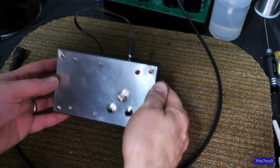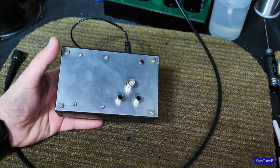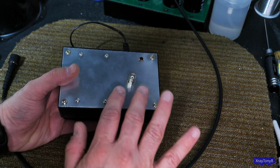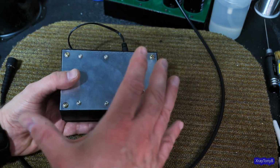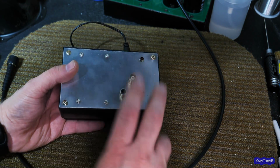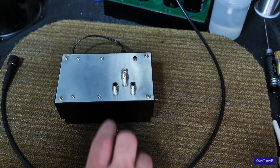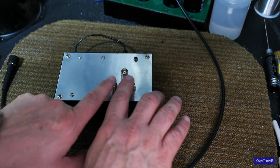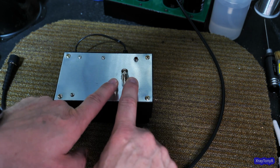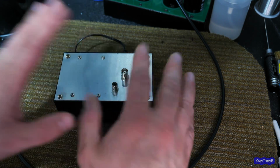Okay, now here is our new pink noise generator. And I'm not sure from the last clips that I did a long time ago what all I said about it, but this is not a stereo output. So there's different types of pink noise generators. The best one is the ones that can put out stereo pink noise that's uncorrelated. What does uncorrelated mean? It means that left and right channel will be random from one another. In other words, they're each going to be random noise, and that randomness is different between the two channels, if that makes sense.